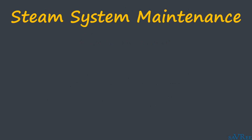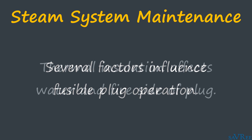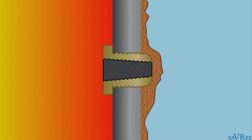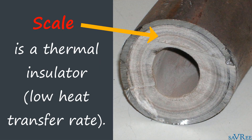Maintenance associated with fusible plugs for steam systems is slightly different. There are several factors that may influence the boiler fusible plug's operation, relating to the plug being insulated and not functioning correctly as a result. Insulating of the fusible plug is a problem that may occur on the water side, fire side, or both sides of the plug. On the water side, dissolved solids may solidify on heat transfer surfaces and form an insulating barrier known as scale. Scale buildup on the fusible plug may inhibit heat transfer, meaning the fusible alloy will not melt and the boiler will not be protected as designed.